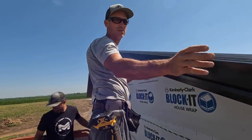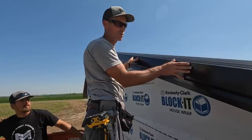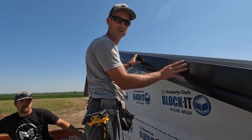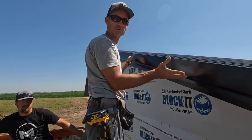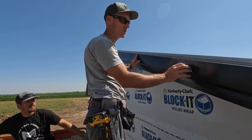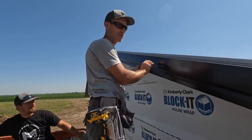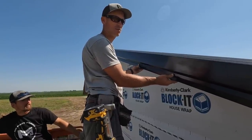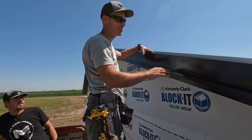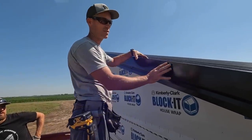When you're putting these in, I like to start at the bottom and get the piece where I want it. You want it to be as square as possible — if your building is not square, this gets more and more difficult. You can get this really close without any oil canning when you put it up, but on 100-degree days or single-digit days this metal moves; it expands and contracts and there's nothing you can do about it. Start at the bottom, put one in, come to the middle, adjust it, put it in, keep an equal reveal. Then put the piece all the way to the peak, put a couple screws in, and as you put a screw in you've got to read the metal — am I over-tightening it? Because when you over-tighten it, you'll see the metal deform from the state it's naturally in.